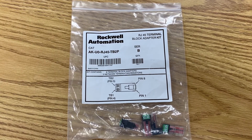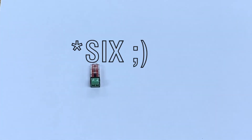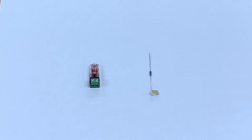In order to accomplish a Multidrive setup, you'll need one of these: a Terminal Block Adapter Kit. The kit comes outfitted with five terminal ends, which allow for transmission and reception of drive data, as well as two 120-ohm termination resistors.